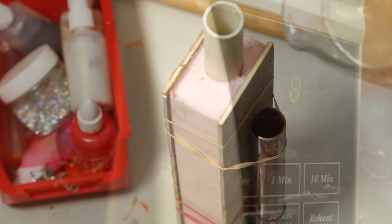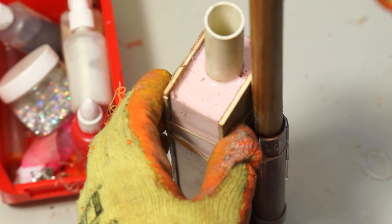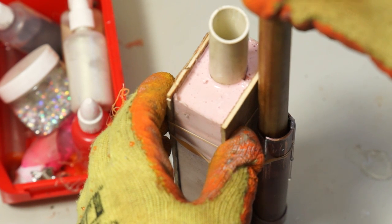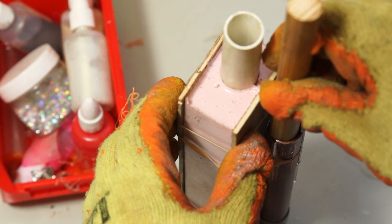To fill the mould, I can start by pouring the plastic into the copper until it gets near to the top. Then it's just add the plunger and slowly press down. I don't need to use any great pressure or speed, but if I take the plunger down to the elbow, it should push the plastic out of the top of the mould and fill the riser.